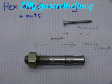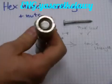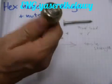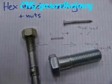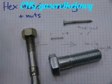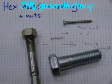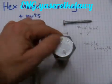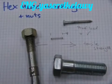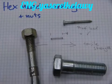So that's the meaning of these hex head markings. Next time you have an anchor bolting job and you lose one of the nuts, think twice about what kind of nut you're replacing a factory original with. Or when replacing a bolt that mounts your engine in a car — think twice before replacing a bolt that costs three dollars at the dealership with something from the corner hardware store for 15 cents. Unless their head markings are identical, they are not going to perform in an identical manner and can easily fail if they are substandard.